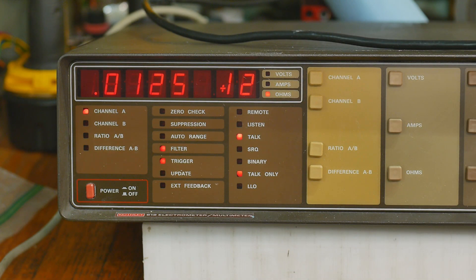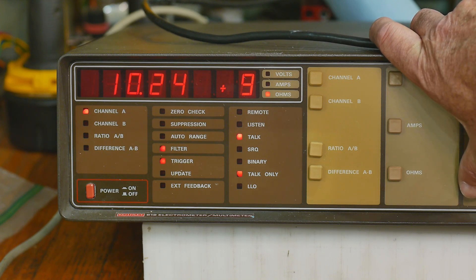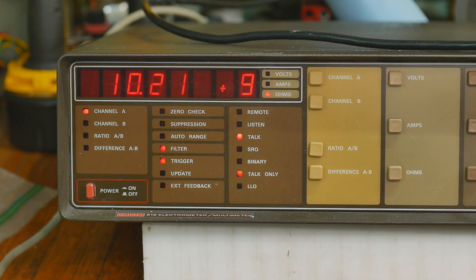Let's put in the 10 gigaohm. There's a long settling time because you're talking really really small voltages and small currents. It's certainly in the ballpark — I think these are marked plus and minus 5 percent, so it should get down to 10.5 gigaohms. Reading 106... 105... 104, getting closer. Let me change the range — there we go: 10.2 gigaohms. 10.1 gigaohms. Certainly within 1% then.